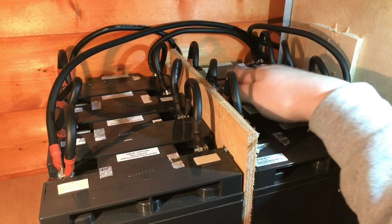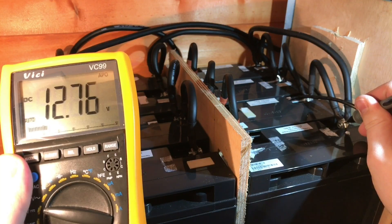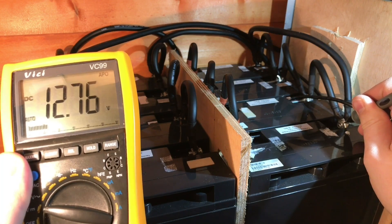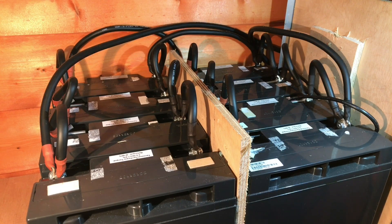I'm fairly pleased that these are all performing quite nicely, but I'll just check the voltage now that they're under load: 12.75 volts. This inverter has been drawing 5 amps for a little while, so that's to be expected — 12.76 volts. I think that's been a pretty good test of this battery bank, and this is something I'll probably do once a month, once every six weeks, or unless I notice anything on the charge controller — the voltage dropping overnight, something like that. I'm pretty pleased that every one of these batteries is working as it should. Hopefully you've enjoyed this video — if you have, give it a thumbs up, subscribe, comment below, and I'll see you next time. Thanks for watching.